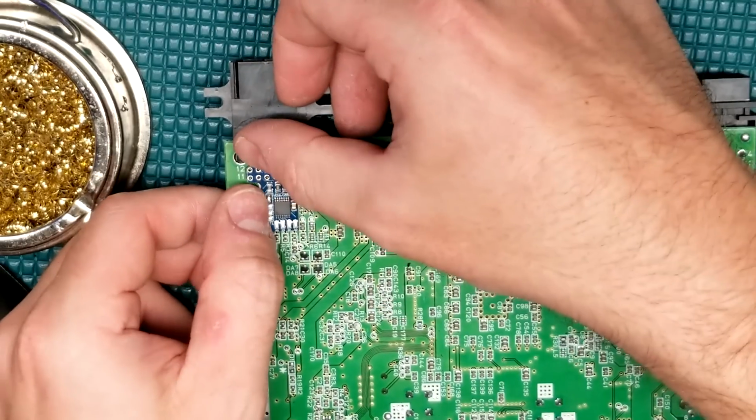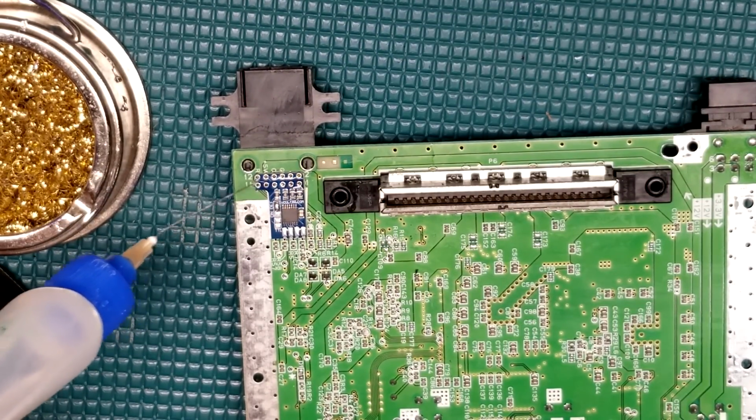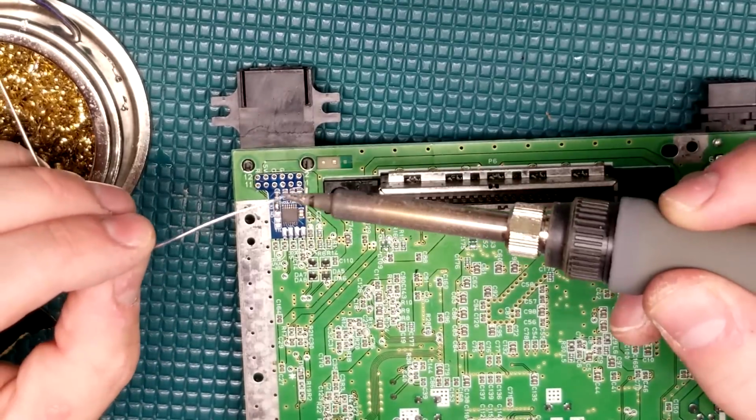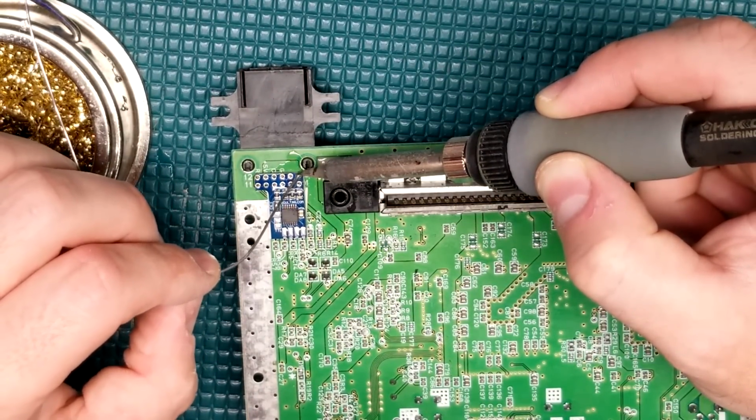For the RGB, we're going to use the Voultar kit, and this is a really nice kit because it buffers C-Sync for you properly on board, which is absolutely fantastic, as well as uses the 7374 chip, which allows you to turn off low-pass filtering.